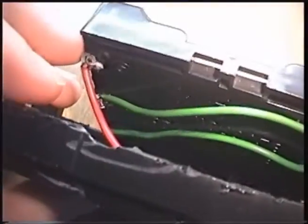There are just two terminals on the battery casing itself — negative and positive — and I've wired those appropriately to this holder. Now I made a dumb mistake: I wired them in series such that I can place the cells all in the same direction, but those green wires are quite long. That's not an ideal design because you're going to have a tiny bit of voltage drop and power loss over those wires. I could have just done a short wire straight across those terminals, which would have been a more efficient design.